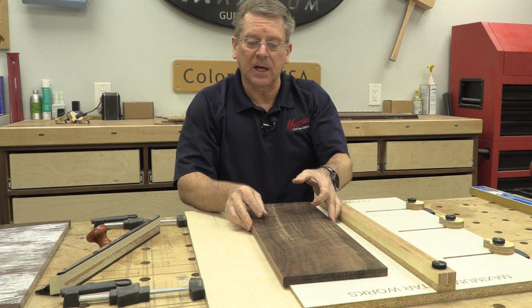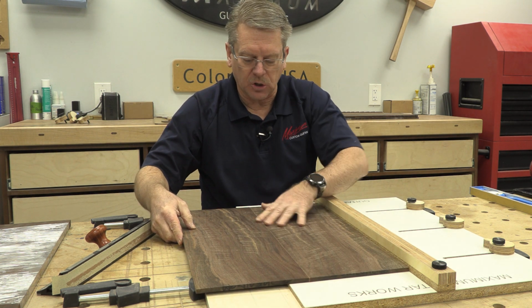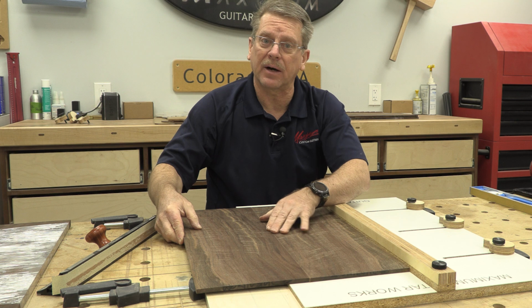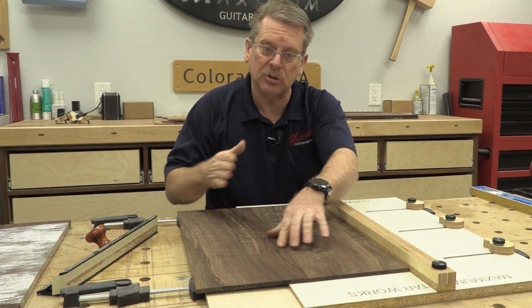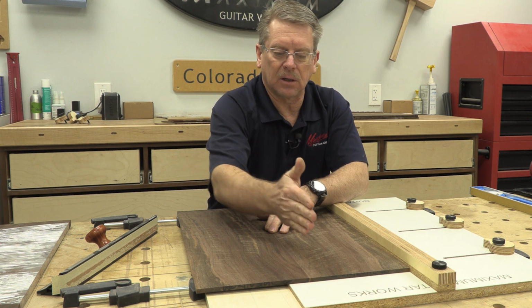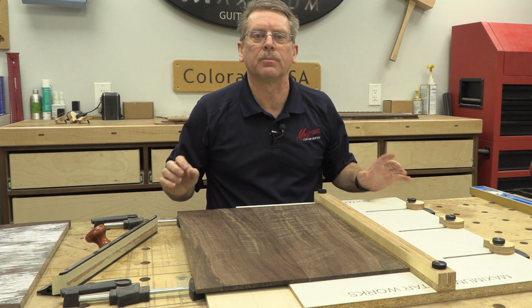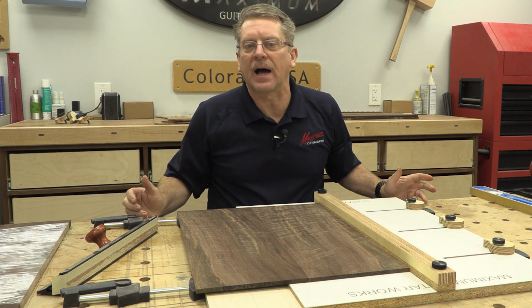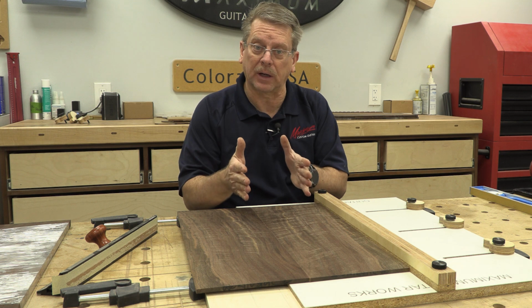And when that is done, you can open it up and look, and just make sure that no changes have happened due to the environmental conditions and caused any gaps or any slight waviness to those sides, and that it is still straight. You've removed whatever, a thousandth, a couple thousandths in order to ensure that's perfectly straight, and now it's ready for glue up.